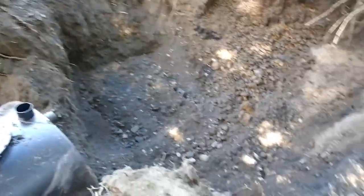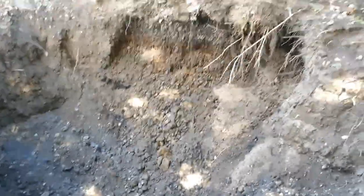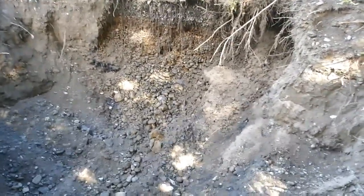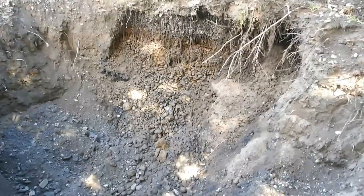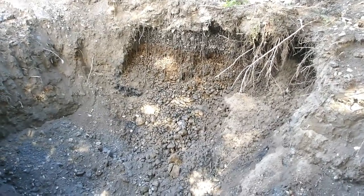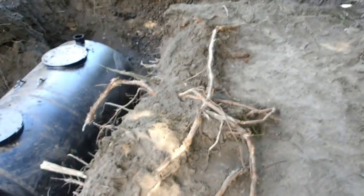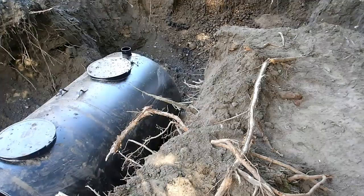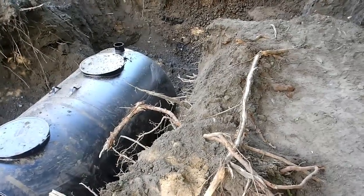Now I just need to set the other drain pit in there and surround it with a bunch of drain rock — probably about three loads of that type of gravel over there, just the right size. There's some biological thing going on that allows for germination that I don't fully understand, but I've got about half of the old drain field still working and I'll be adding this whole area to it. This tank will definitely be buying me some time — now I've got to use a thousand gallons of water before it even comes out the other end, so I'm not as pressed. Probably have a few weeks before I need to get the rest done.